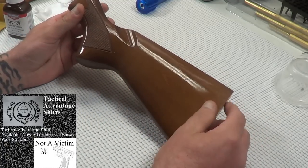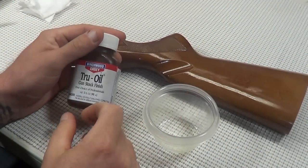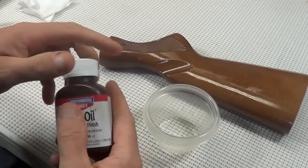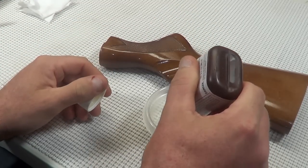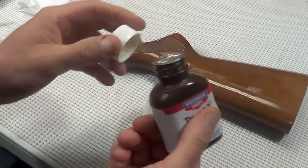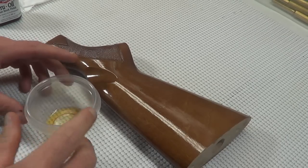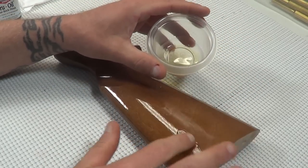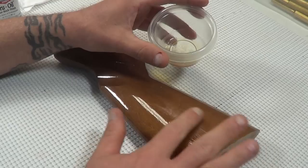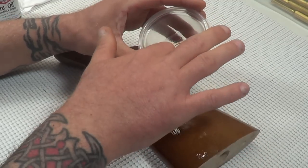Runs are okay — I want to show you guys how to deal with it. You just knock it down between coats, no big deal. Just like part two, we're going to get our Tru-Oil in the secondary container — we're not going to need very much, you can always go back and add more. Today is a little different than yesterday. Yesterday we basically just tried to get a coat over the whole stock. Today I'm going to do probably a three-by-three area and I want it to be somewhat thicker than I was working on yesterday.